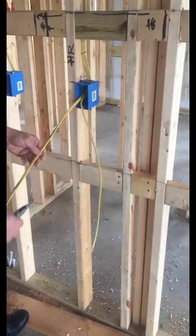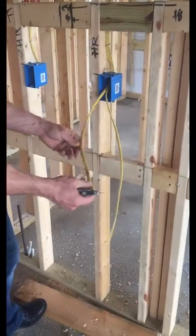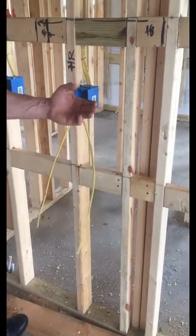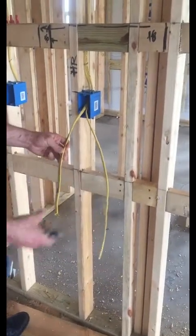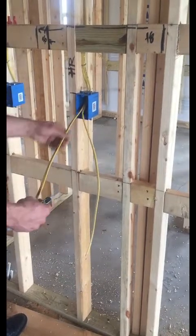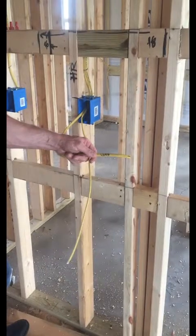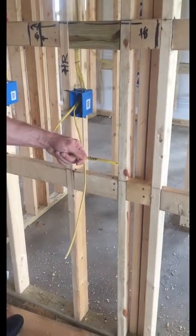This is a small appliance circuit for a kitchen. The kitchen has to have two of these, and this is where we have our home run coming in, which then goes off to the rest of the kitchen. This begins a regular chain of outlets, but since kitchen circuits have to be protected by a GFI, you mark the home run line — that's called the line side of the GFI.